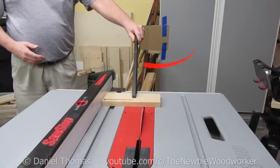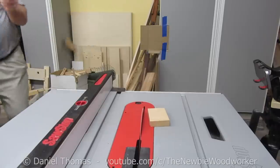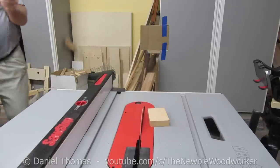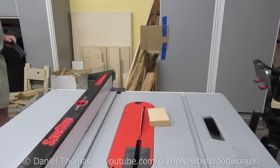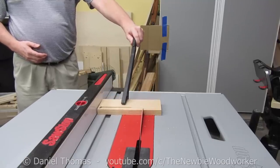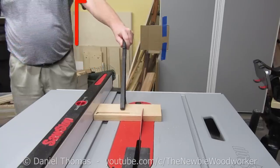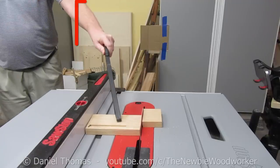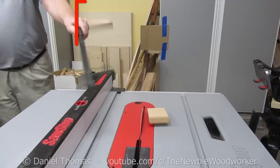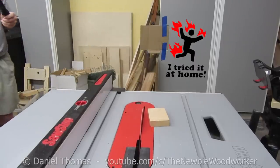Let's look at the second example. I've added some cardboard here to help soften the impact. Well that was unexpected. Let's look at that again. I'll slow it down a little. I guess the cardboard wasn't needed after all. Let's see how close I came to getting injured. As I start the cut, here's where my body is, and here's about where my shoulder is. As I continue the cut, I keep moving away, which turns out to be a good thing. At this point, the board's just past my body. The board probably would have missed me, but not by much. Even with all the precautions I took, I still came close to getting nailed.